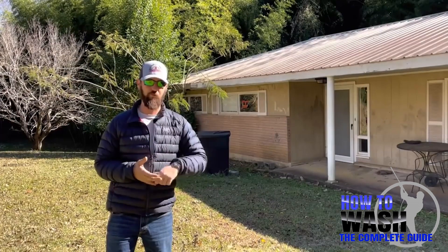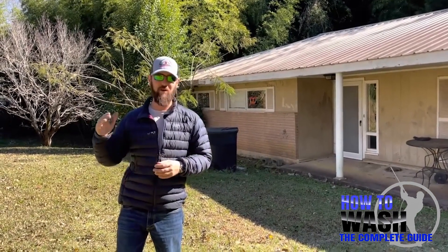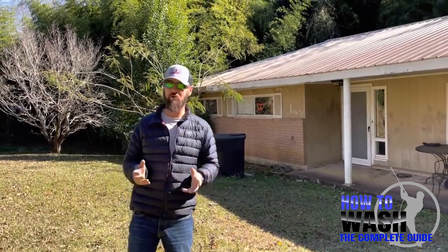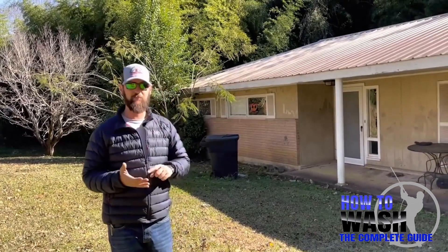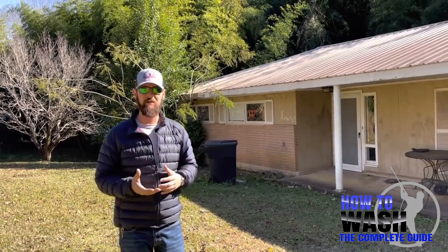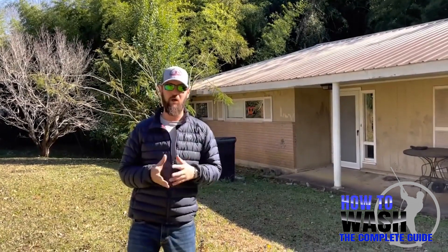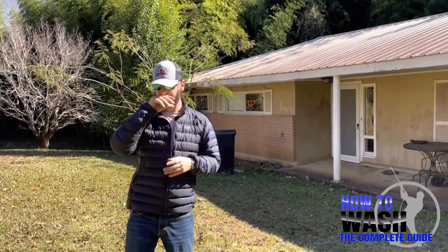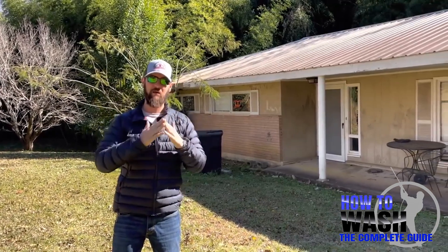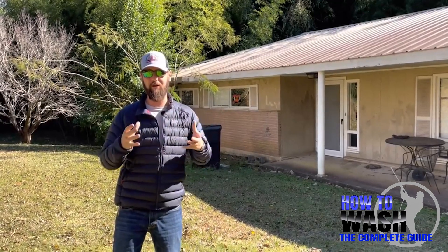Here's your percentages: anywhere from a two to a five percent mix. You've got to be really careful going from two to five percent — that's a massive change in bleach strength. You don't want to go any hotter than you have to. Will it clean at five percent? Yeah. Will it clean at twelve? Yeah, but you're going to mess up a lot of things. Start around two percent and work your way up. It's the middle of November but pretty warm in Alabama, so we're probably going to be at about a four percent mix. It's really nasty, and it's not very steep of a pitch, so that may push me up a little in strength — the steeper the pitch, the quicker it runs off.